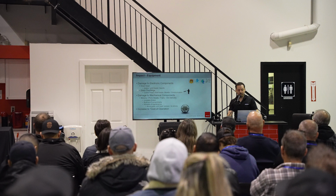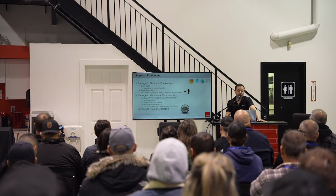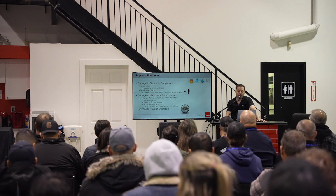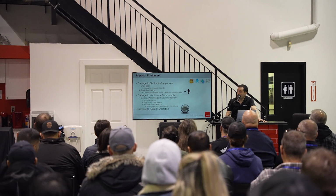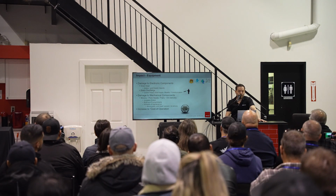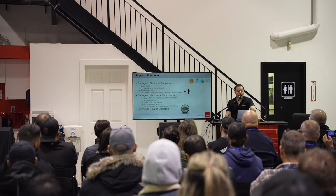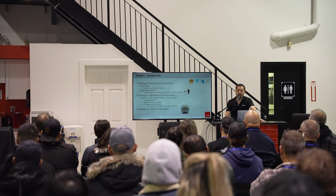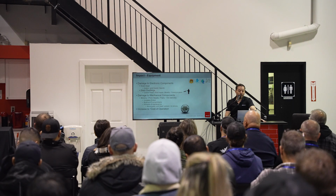All right, so what can happen? So with the wrong temperatures, you can have an overheat of the motors, print heads, and boards. So the machine's already got heat in it. It's got fans to cool it down, but if your environment isn't correct, those fans won't be doing much. Static discharge, so we talked about humidity. So what'll happen is if it's really dry in your place, the ink won't jet properly. You'll have some misprints, you'll have some blurry prints,